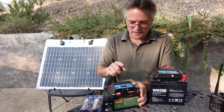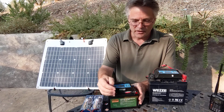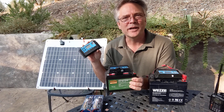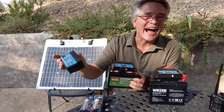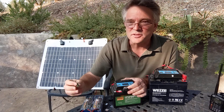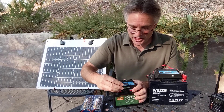When you wire your radio up, use good gauge wire — 12 to 14 gauge, like your radio would use. These systems aren't fused by default. The solar charge controllers will cut current if overloaded, so in a sense they act like a fuse, but I still wouldn't trust it. Go ahead and add blade-style automotive fuses. I've got a 30-amp blade fuse here — the house you save could be your own when it comes to fire. If there's ever a short, this blows before your radio does.